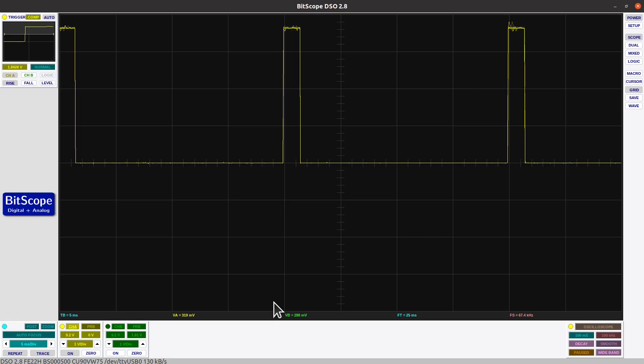The real reason for putting this on the oscilloscope is so I can look at the voltage. We've got one volt per division and counting the divisions we get approximately 3.6 volts. I'm looking to put this onto a Pico which is designed for 3.3 volts — it probably should be okay, but I think I might just put a small resistor voltage divider in there just to make sure we don't cause any damage to the Pico.